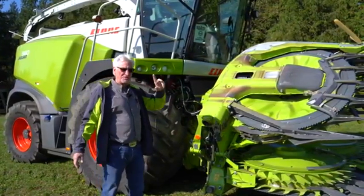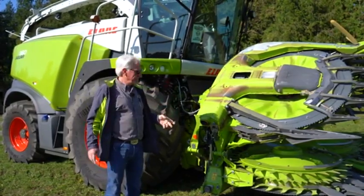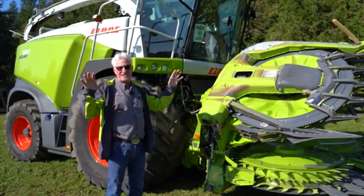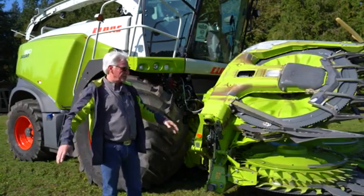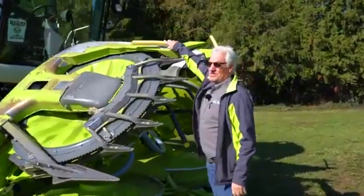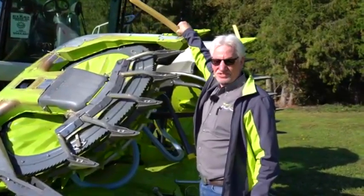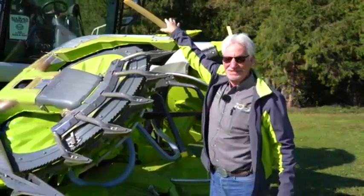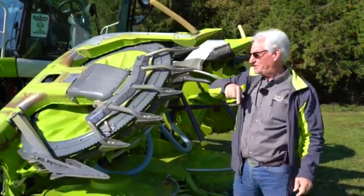And I don't know if you noticed while we were folding, the other cool thing it does is if you push the fold button and it tells the chopper it's not in the right position, it automatically raises it, so that's in the right position to fold and to transport. Likewise, on the unfold, it does the same thing. One of the things it's trying to compensate for is it doesn't want you screwing these things up. And this is your auto contour that adjusts your head height and adjusts it like this. At the same time, it adjusts the height and keeps you from scalping this. And we'll show you this in a little bit on this uneven ground.